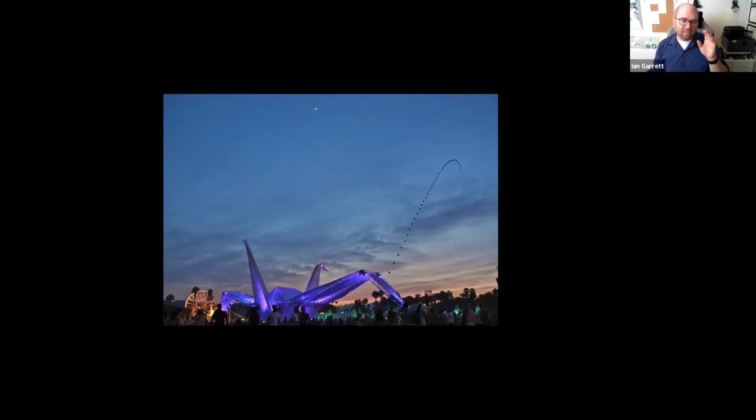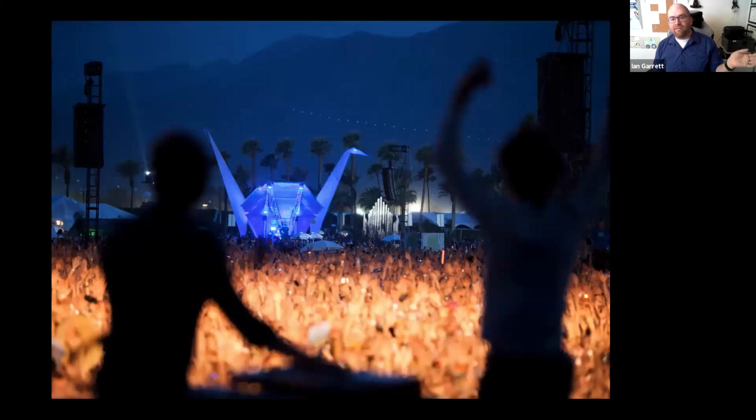is that we've got this power ceiling that we've established based off of the maximum draw of the fixtures that are installed on this unit. And we end up never using it, actually. Due to the nature of the consumption from an LED source, it's nearly impossible to use the maximum unless we left it in white the entire time. So with these three emitters, it ultimately didn't shut itself down by the end of the day.